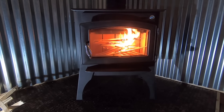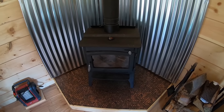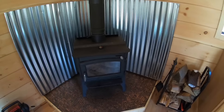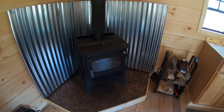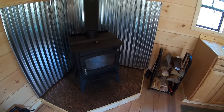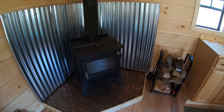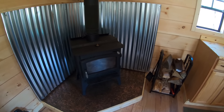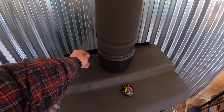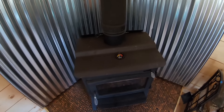The wood stove in this case is designed for over a thousand square foot house, and this is only about 200 square feet inside. There was one night where I put a log on the fire, put the air all the way down, went to bed, and I woke up in the middle of the night and it was almost 90 degrees — you felt like you couldn't breathe it was so hot. I had to open all the windows and let the fire go out, and it got really cold. When I woke up in the morning it was about 52 degrees. I ended up adding another damper to the top of the wood stove — even though on an EPA stove you normally wouldn't do this — and it has helped slow the fire down and give me better control over the temperature.